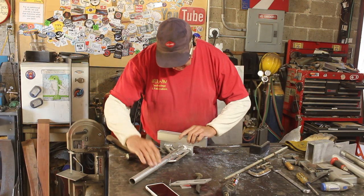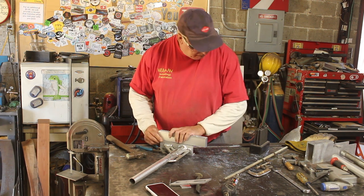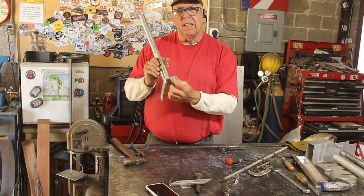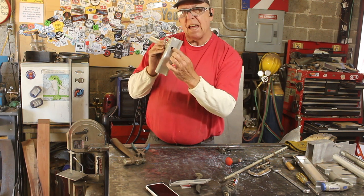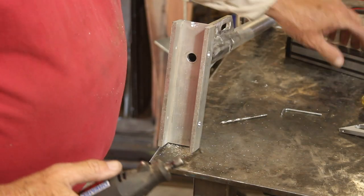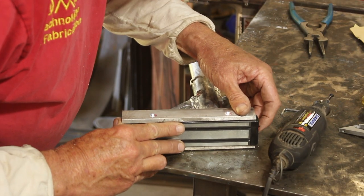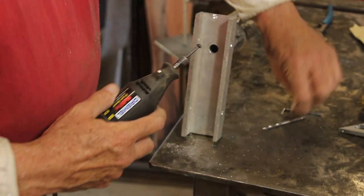This is welded together now, and it's not the prettiest weld, but I've never had one of these ugly welds break. Now we'll come in with a transfer punch to locate the holes for our electromagnet. Hopefully there'll be enough space between the top of the magnet and that hole that I can run the wire up through the middle of this to get power to it. The clearance is a little bit tight to fit my larger wire, but that should fit just fine. I think I want a little more clearance so I'm going to go ahead and hog that out a little bit.